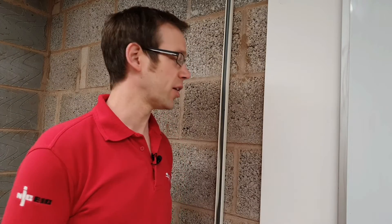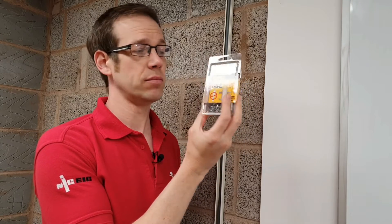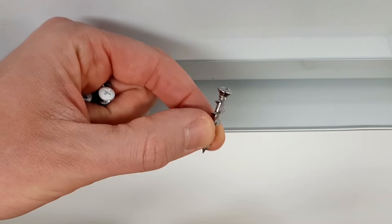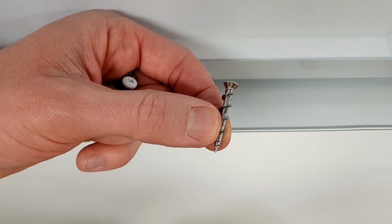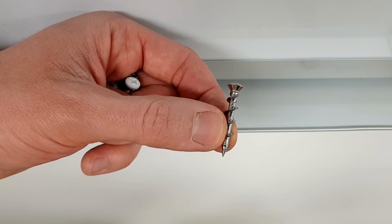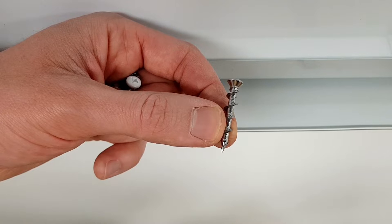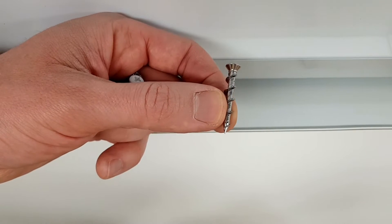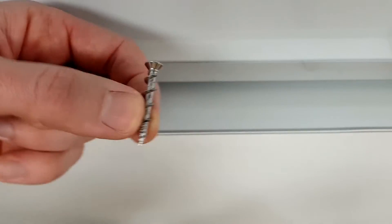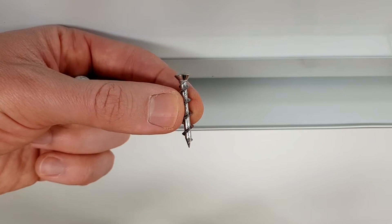There's been lots of debate about whether you can use plastic wall plugs when installing a fire-rated fixing. We're not about to enter into that debate — we're simply going to look at an alternative: the Wall Dog by DeWalt. The DeWalt Wall Dog is a fantastic fixing designed to screw directly into lots of surfaces including brick and block. You need to drill a 5mm pilot hole, and it can then be driven directly into the material — no plastic wall plug required. These have been tested up to 120 minutes in a fire-rated situation with 20 kilo weights hanging off them.